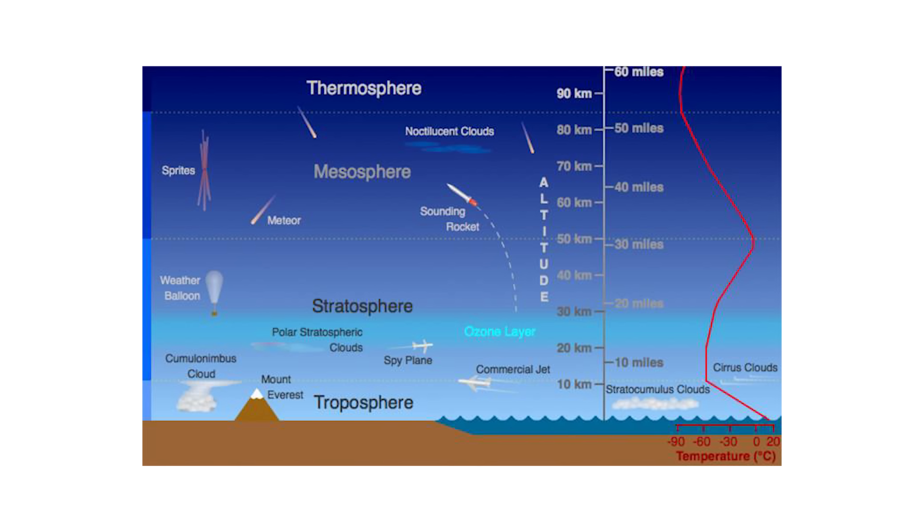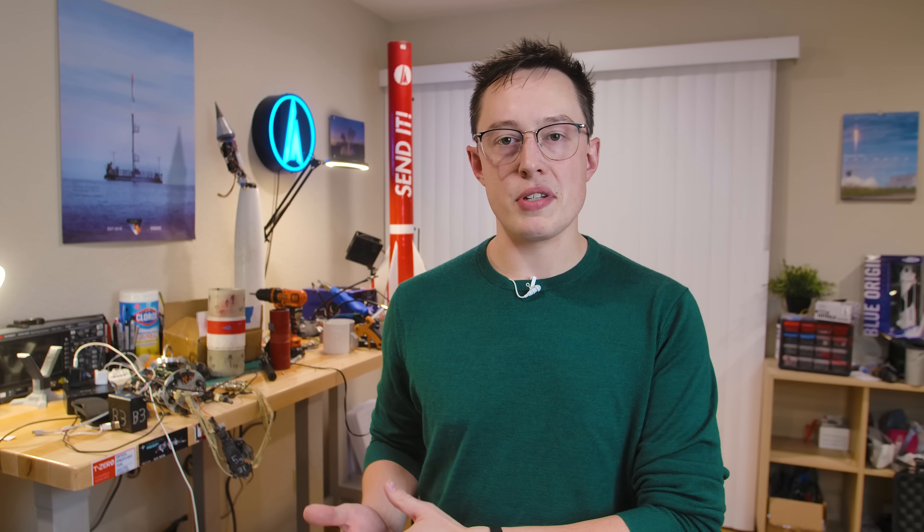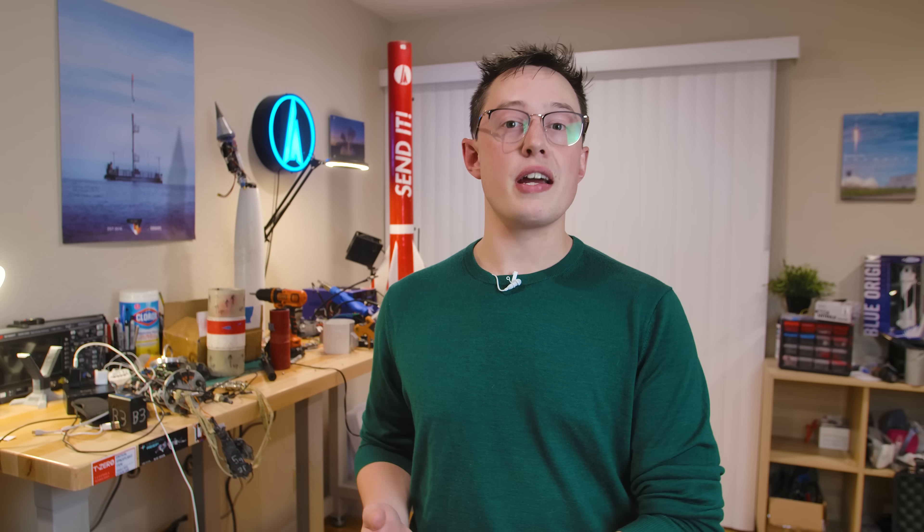The third con is that a spinning rocket is a good thing. Stability is difficult in the stratosphere and mesosphere — you have almost no air to work with up there. As your Mach number increases, the shock waves moving down the vehicle make fins less effective. So the reason we spin the rocket is to improve stability in the upper atmosphere. Designing for space shot. So if the rocket needs to spin, let's try a different idea.